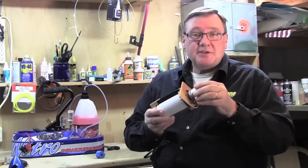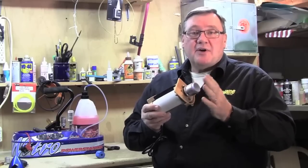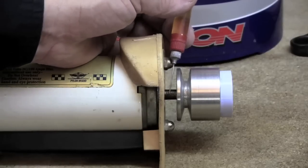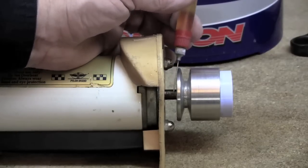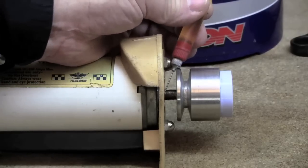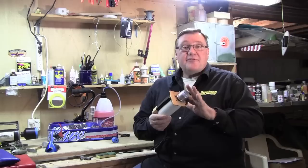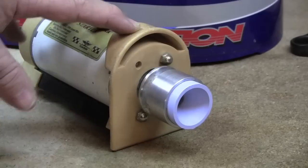You want to make sure that the cone section isn't damaged, and that the rubber insert is pressed all the way in as far as it'll go — that way it'll run true when you put it on your airplane. In between the cone section and the body, there's a little space where the output shaft is. Always check that and make sure there's no dirt or debris there. I like to use a little bit of lightweight engine oil and put a few drops in there to keep that front bearing nicely lubed and corrosion to a minimum.